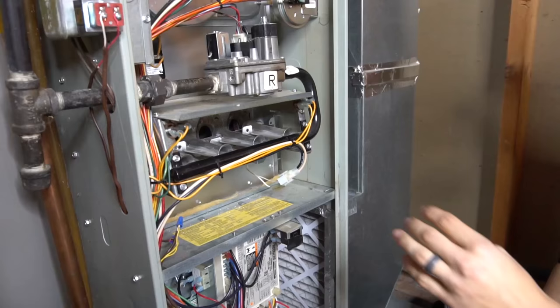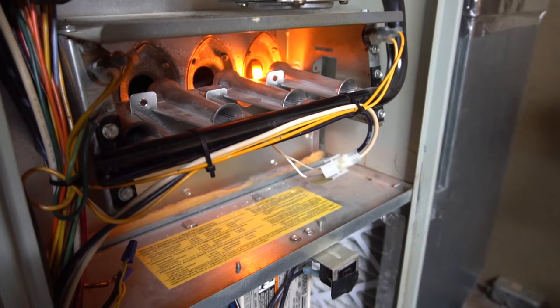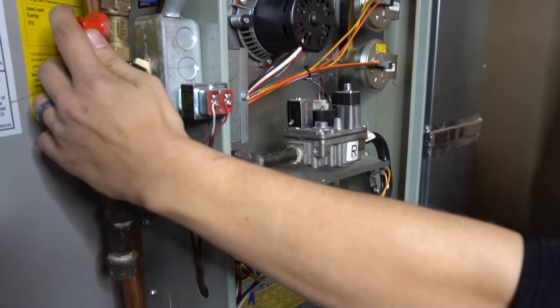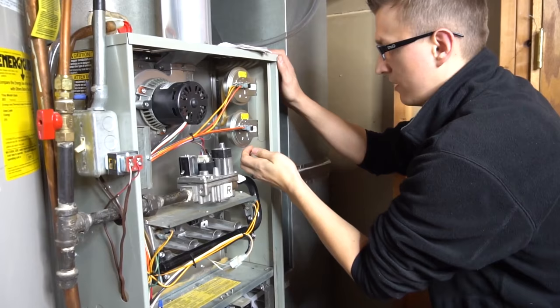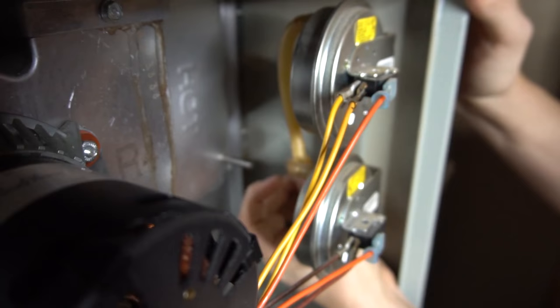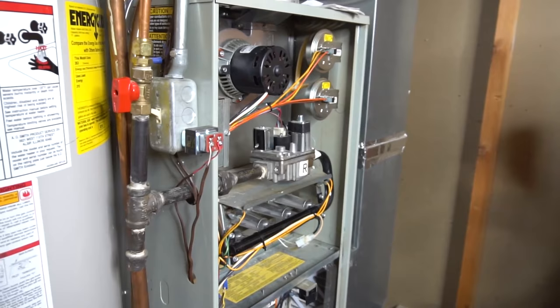So let's just turn the gas off to the furnace quick and let it cool off for just a little bit before I hit the power switch. As you can see, my furnace is already trying to restart — the igniter is glowing, and you're going to hear the gas valve click. But nothing happens because my gas is turned off right here. Now let's do an example scenario. Here's my pressure switch hose — let's say for some reason there was some gunk that built up in here, some rust or scaling, and this port was plugged, therefore my pressure switch was not sensing any draft. I'll leave that unplugged and see what happens.